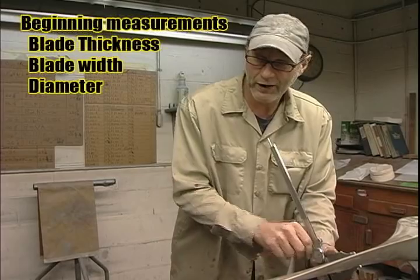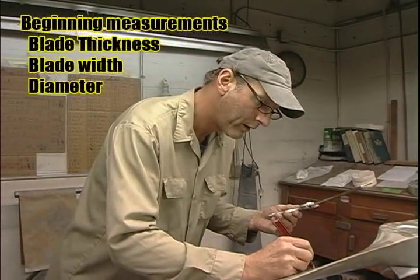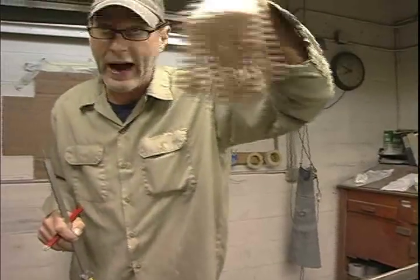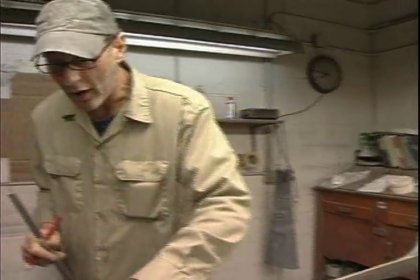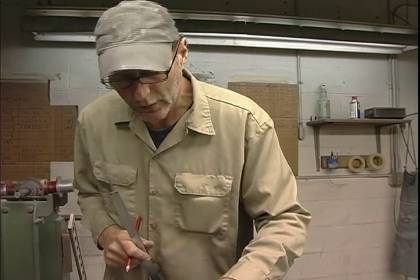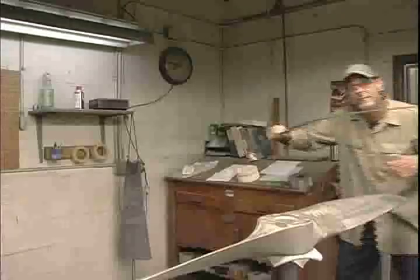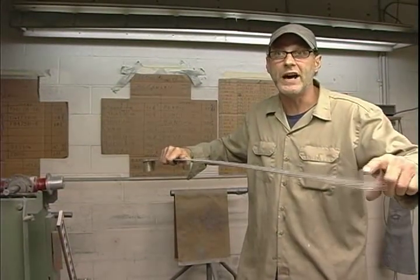What I'm doing now is getting all the numbers — before numbers — write them down, and then I'm going to check edge alignment, tip elevation, track, all that stuff before I start, because I can always adjust it as we go. The reason why you want to do an overhaul instead of a field repair is because the more a propeller flies, this is happening to the blade as it's flying, especially out at the tip.